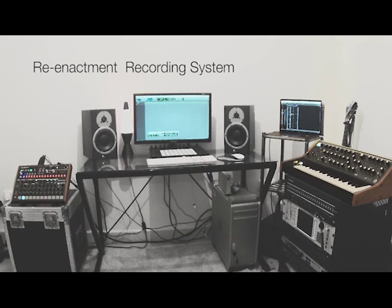Because the Roland MC4 had only four tracks, and because Clark was working alone, it was imperative that he was able to overdub additional tracks to build up more complex song arrangements. Whilst the MC4 could generate a synchronization pulse, for this overdubbing workflow to be possible, Clark had to make the tape machine the master device in his studio. He achieved this by recording the MC4's DIN-SYNC pulse signal onto a spare track on the tape.